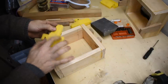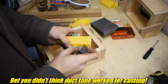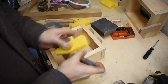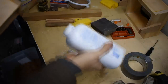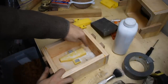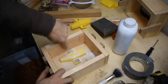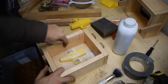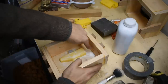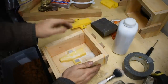How am I going to keep sand from going in there? Obviously duct tape. You might be asking: will duct tape mess up my ability to get this pattern out of the sand? Well, we are going to find out together. Now they always tell you to want a little bit of space between the pattern and the wall. But remember, this is going to have a core in it, so this isn't going to have any metal. So I can put it right up against the wall - not super close, but reasonably so - and know that metal is not going to be in there, hopefully. I'll make sure I have space along here and then put the risers in the other side of the flask.